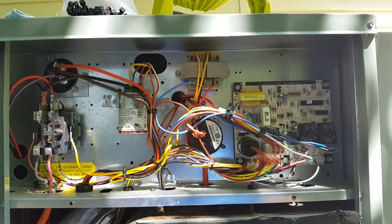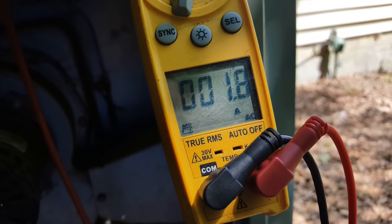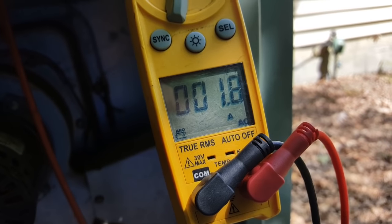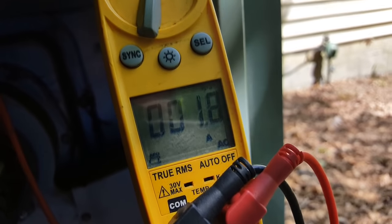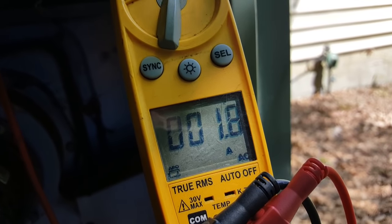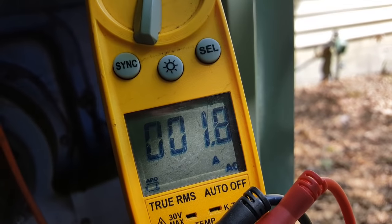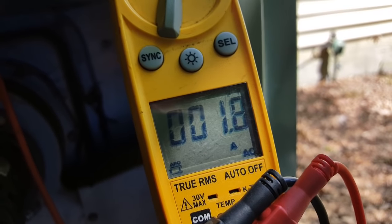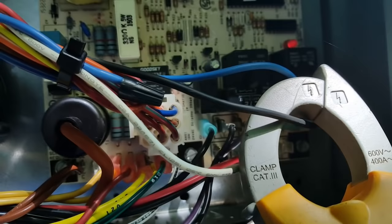I'm going to restart it — wrapping this thing up. Here's our amperage on high speed: only 1.8 amps, still well below the 2.7 the motor can handle. More than likely that's because of the high static pressure — PSC blowers, as static builds, the electrical draw goes down. So it's not doing much compared to what it can do, but it's doing everything it can to get CFM to this system.